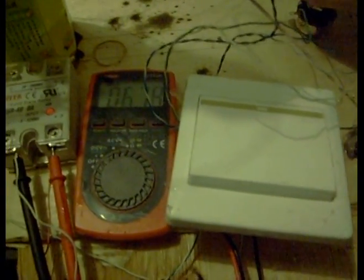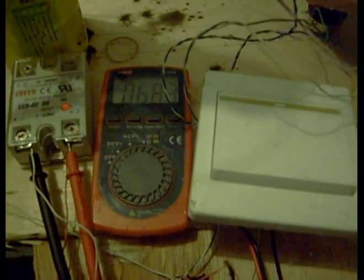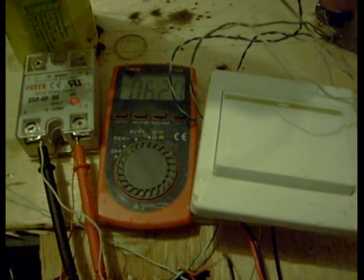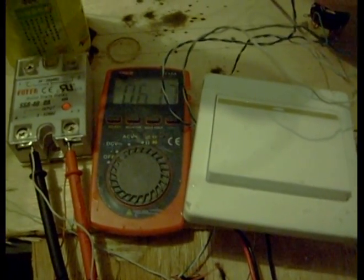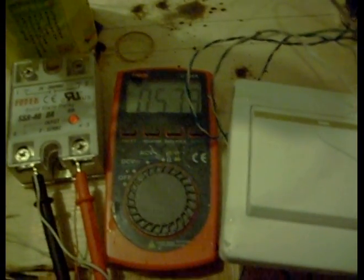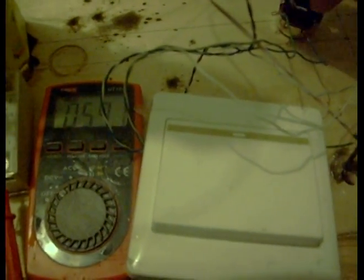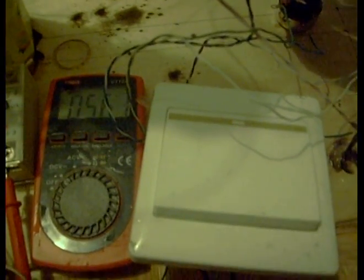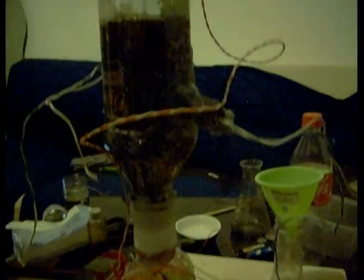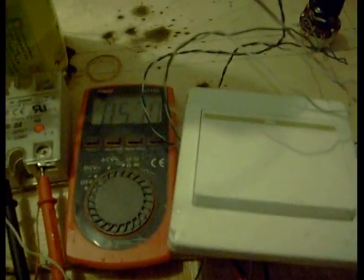Now it's going down — that's probably because I'm using up my salt. It's relatively stable. The reactivity is not as clean as I'd like. We're dealing with relatively volatile conductivity, which we'll have to work on — probably because I'm using way too much voltage and oxidizing my anode. So we're going to flip the voltage down a bit and try again at a lower setting.